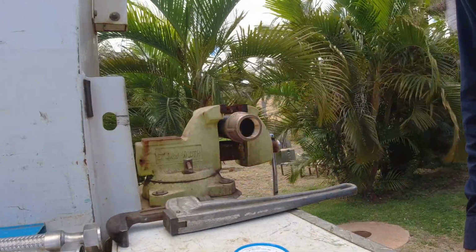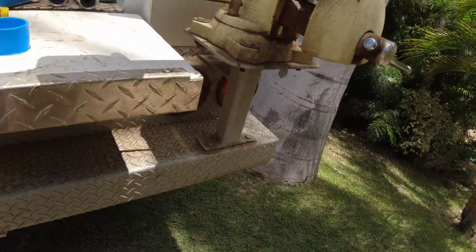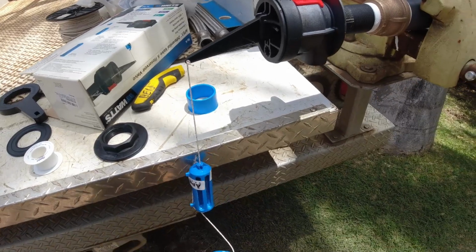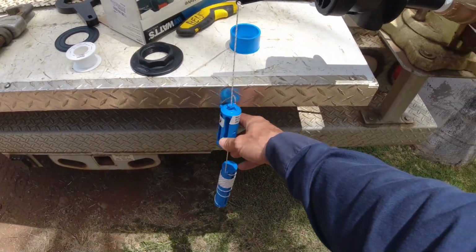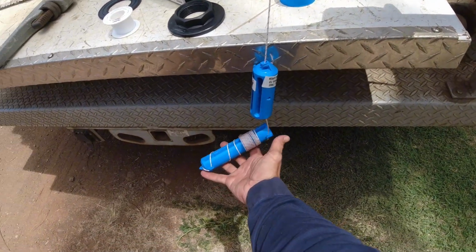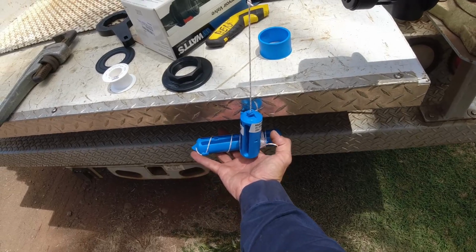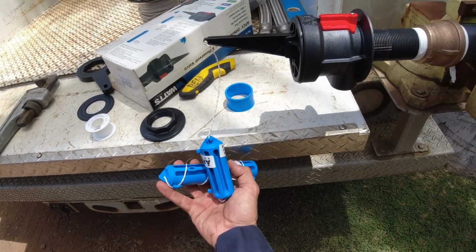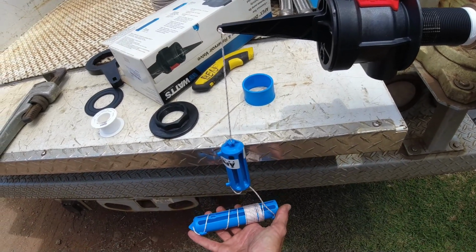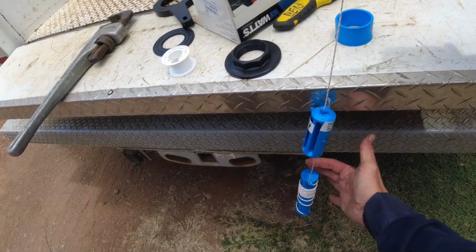The customer we're going to today, they're on an irrigation system that provides water that is sometimes turbid and cloudy, sometimes outright brown and with sediment in it, and even sometimes debris makes it through. They have a strainer on their system, but the turbidity and the sediment, the fines in the water, can cause problems. And so they've had a solenoid valve controlling the filling of their tank, and we got the call about a day ago that the tank was overflowing and that the solenoid had failed to shut.